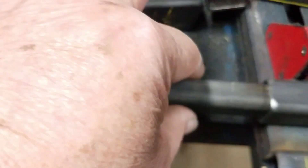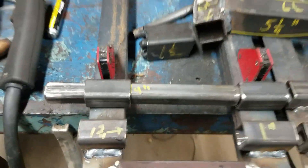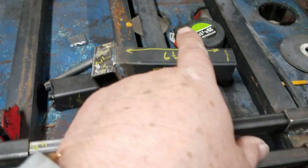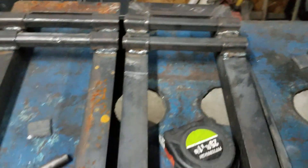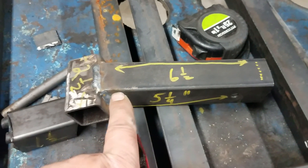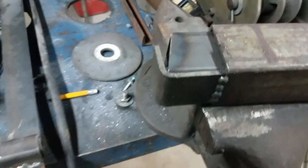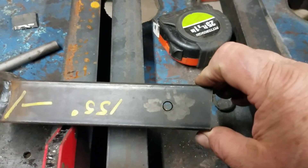When it's tacked, the piece still slides, and you can really put the heat to it. You realize when you're done that the bar is going to slide all the way out — and that's the way we want it. So that's how we built the torsion arms. Another thing: I had a problem drilling straight through the holes on my drill press. It's a pretty good drill press, but bits tend to wander, and on my first set the holes were wandering a little bit, so everything wasn't running straight.